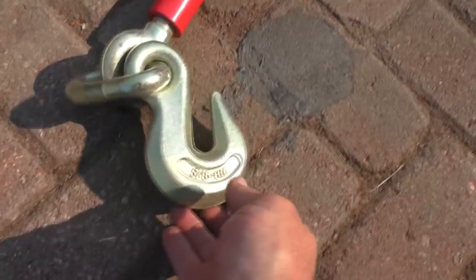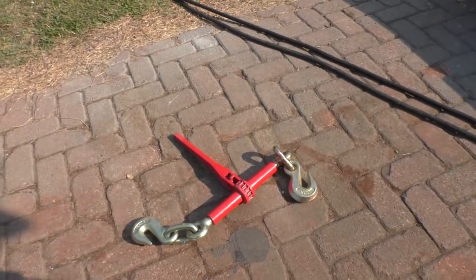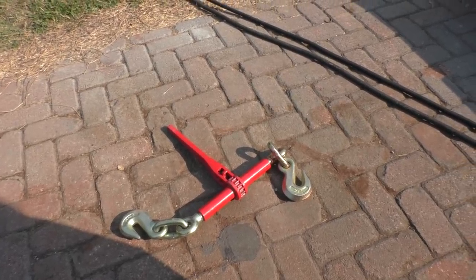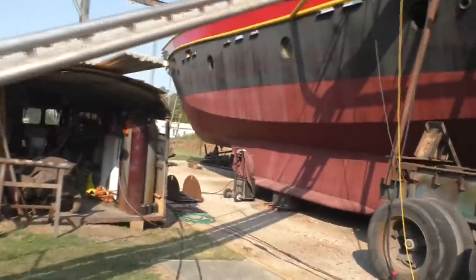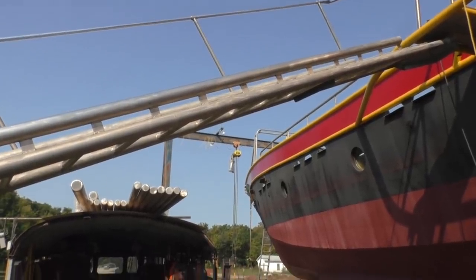Oh, I see the 5/8 inch hooks on it. And that's what we've designed to lock into. And so all of that is rated for how much? I think it's 40,000 on that one, the working load. But the chain's only 10,000 working load, and I got three of them. You're so high instead of anchoring low. Because I can drill through up high all the way, and I bolted it with a plate on the other side. You want to go up and look?